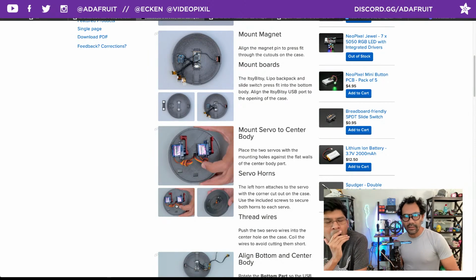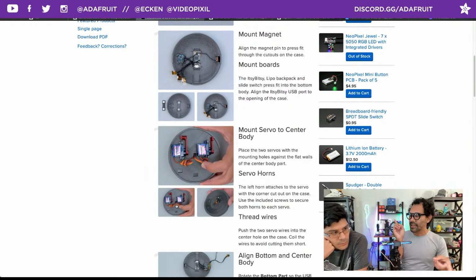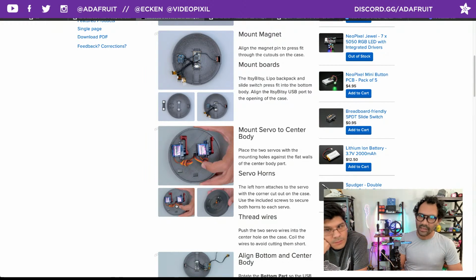And you can see I have a cutaway there because I had designed it thinking that you could mount the servos opposite of each other. And I didn't think that one's going to be rotating 90. To get that same thing, you'd need negative 90. So I was not able to code that.